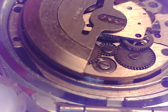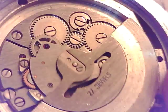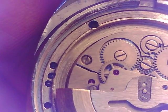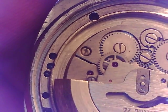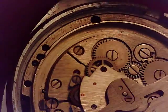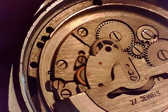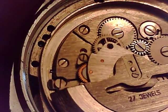When you wind this through the stem, you'll notice the auto winder winds with it — parts of them. And if you look at this winding gear here, it's got a clutch. It overruns. You can see it turning right there. It's an overrunning clutch — it's just slipping through that one-way gear. So that's a demonstration on how that works.